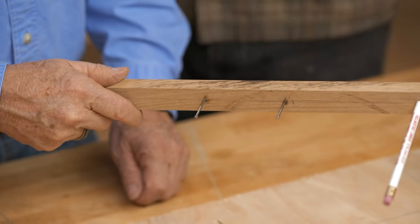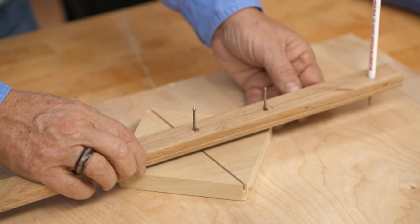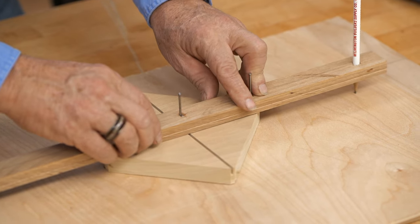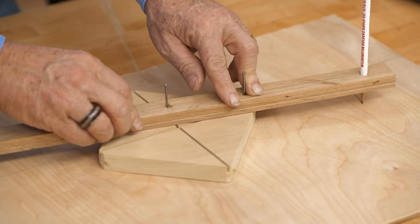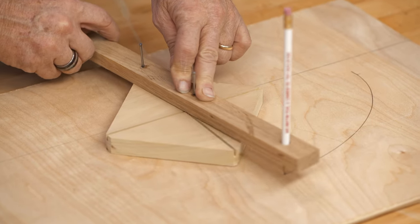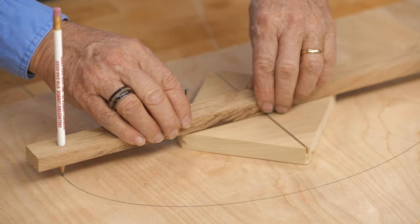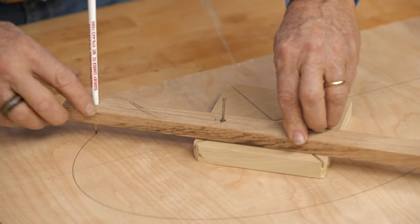And that's kind of the idea. An ellipse has got two focal points, basically — two axes. All I do is I take the nails with my pencil that's sticking through, and I keep the nails in both tracks, and I'll draw a half of the ellipse right here, bring it around, keep going over to the other side. Look at that — I have an ellipse. If this board was wide enough, I could go all the way around. It does just make it.